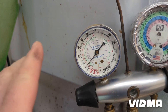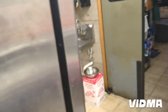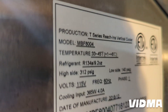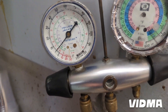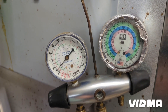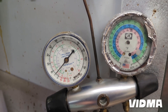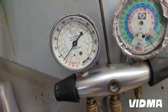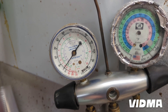If you have it in vacuum — 10, 20 pounds — you know it's too low. To know what kind of freon it uses, it says right here: 134A refrigerant. You do need to be EPA certified to handle freon correctly and charge the system. I don't recommend doing it on your own, but it can be done — as long as you're not letting refrigerant into the atmosphere. That's the main concern. Recovering refrigerant and replacing compressors is a lot more involved than just adding a little freon to the system.